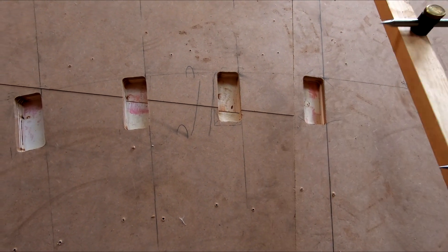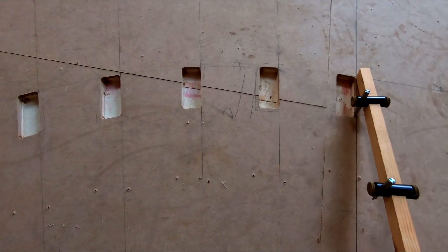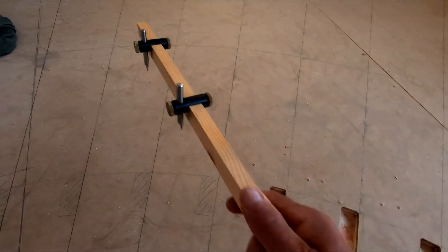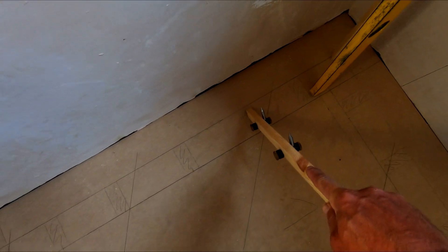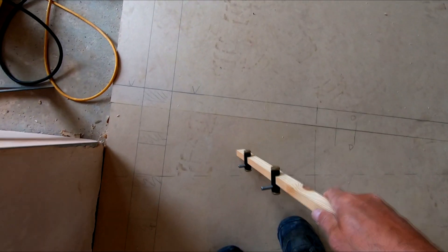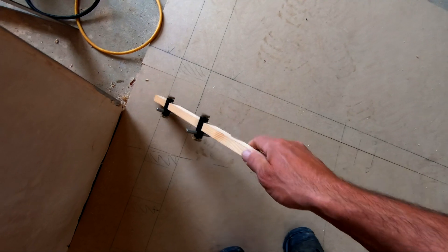When I first set this out, I worked out the arc would be around 165mm at the centre. When I actually threw the first divisions through, my trammel stopped about a millimetre short, so I had to gain a mill — I moved this by a mill and then re-ran all of the tread lines again, finishing nice and perfectly. Then you set them all out running all the way through on the arc, come back to this point line here, line everything through, and you can see I've got more cradle sections going on here which will take the string line along this side and along here.